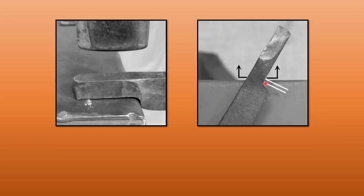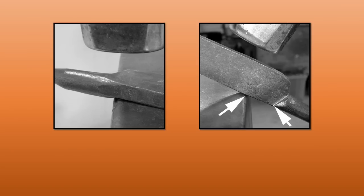In the right-hand slide, the shoulder or crease is right at the bottom, slightly back from the edge of the anvil — that's to allow for the creep of forging over the anvil edge. With a normal pair of tongs on three-quarter inch square you'd get a lot of creep, but with the scrolling tongs we're actually going to line up that section right with the edge of the anvil. Half-face blow again — two-thirds, one-third, working off a radius edge — trying to set up a nice shoulder, with the shoulder about the same angle and length as the top of the boss.